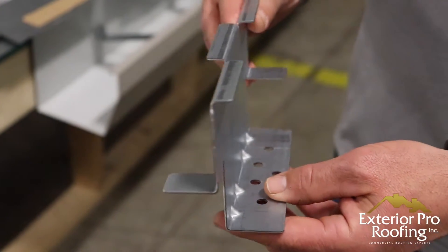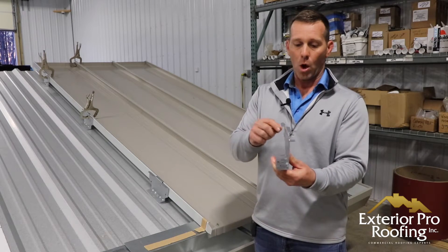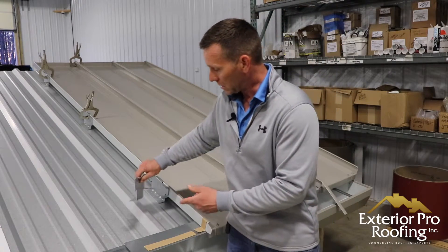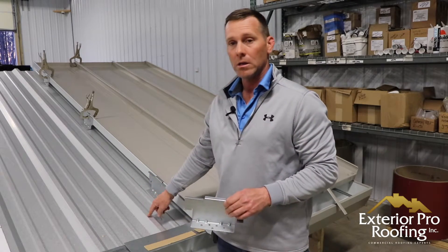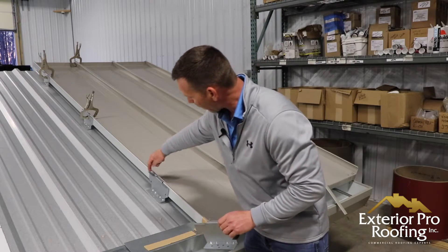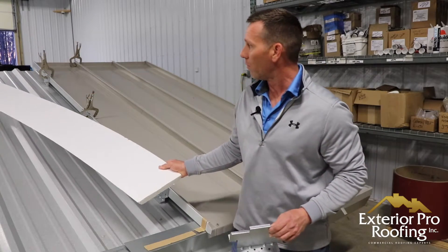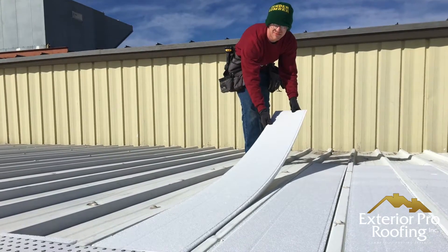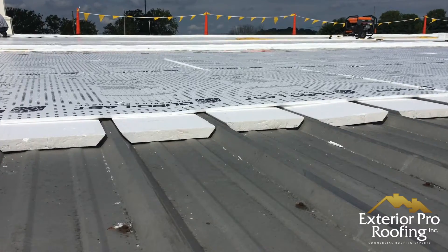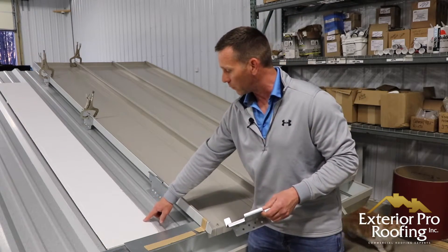Here's what the clip looks like — here's one installed and here's a loose one. It has a shelf on the side that holds the panel up above the profile. This is a high clip designed to sit above R panel, which is a very common steel building panel found throughout the United States. The clip allows the metal to sit on the shelf above the existing panel. We also use the same flute fill from the membrane side here in the middle of the panel — not where the clips are, but in the pan — to give the new panel a little more support while spanning.